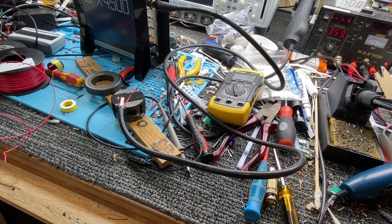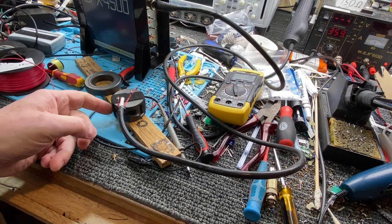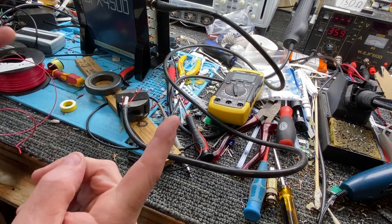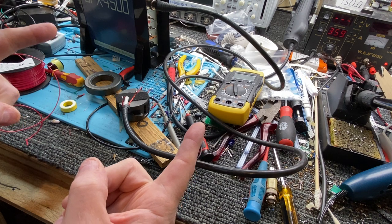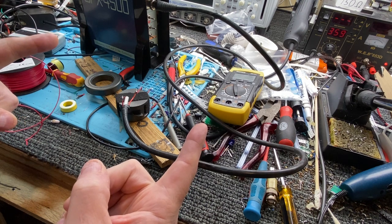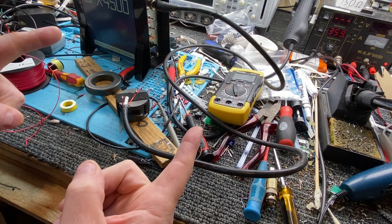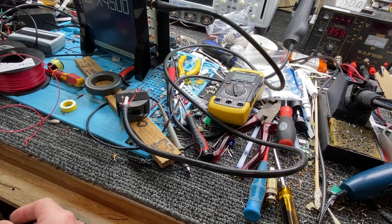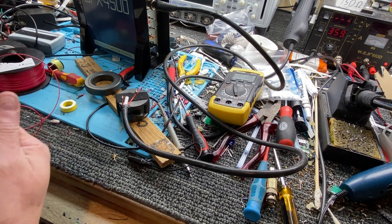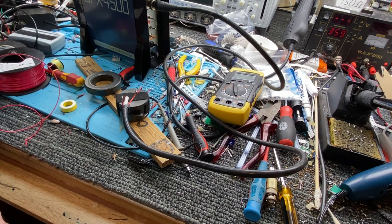Sorry about that, but if you do want to make your own gadgets — like I say, you can make them out of the stick ferrites. I think they come from Russia — I don't know if you can buy them anymore the way things are over there — they're about that long, like a big antenna ferrite rod. You put on as many winds as needed and you can make a really good pinpointer out of it. It's very sensitive if you put the coil at the end and poke it at things.